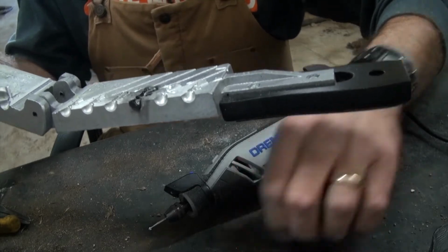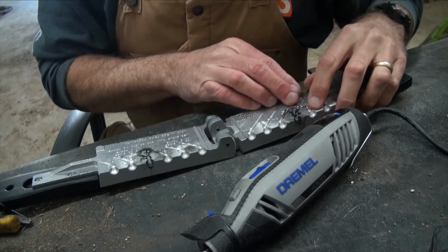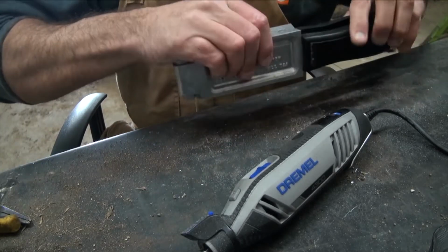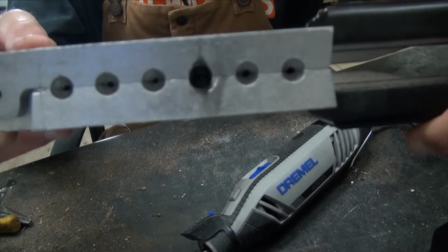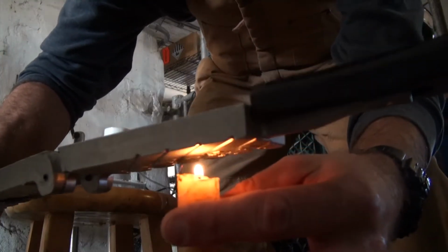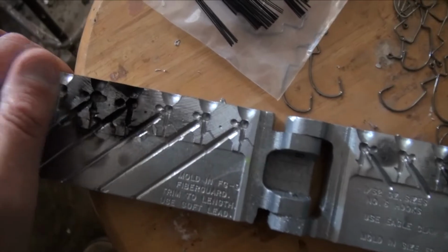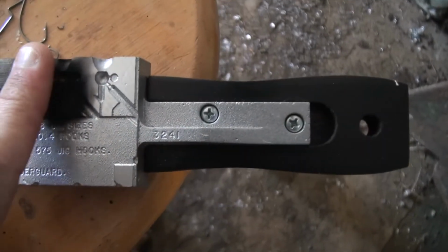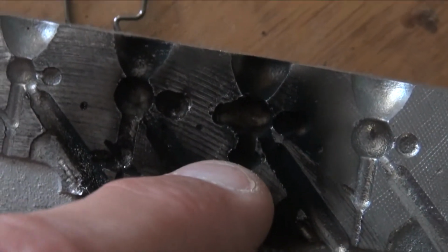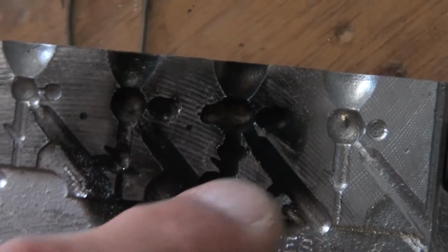But for now, that's as far as I want to go before I go any further. You can't put any material back in, but you can take more out. But it's closed up pretty good. Let's go pour. So we do this just to get some soot in there as a release agent. All right, got that all sooted up. We'll kind of wipe that surface off so you can see. I also put a little bit of a collar in there for me to tie on, but that's a good looking half mushroom, half football head shape, and I got room for the fiber guard.